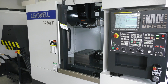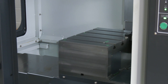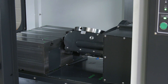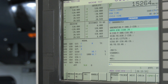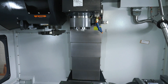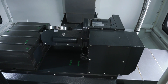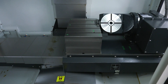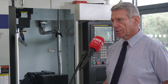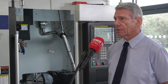The rotary table is 360 degrees continuous — it'll reset every 360, so on the screen it'll only show zero degrees when it reaches 360. On the angled head we've got minus 140 degrees, which is towards us, and plus 40 degrees, which is the head going away from us. You could do the majority of the work with it facing you and just index it through an additional 90 or 180 degrees — that's right, you could go 180 degrees and still work on minus 120 this side, working on the other side of the component.